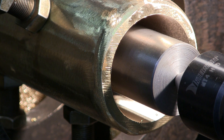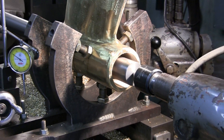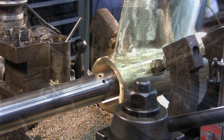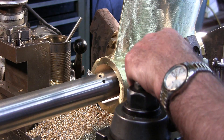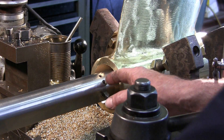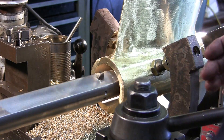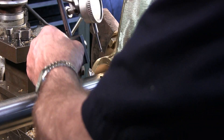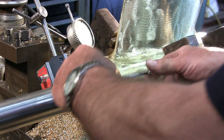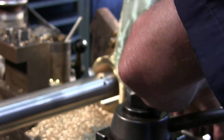The bar has been working super great and we're really happy with it. Now we've been using this angle bit here and we've extended it out — we have a little plug that we put in behind our adjustment. When we first started this job, I drilled and tapped two holes back here, but putting the indicator and adjustment tool bit on that side was not comfortable to me. I realized it was a lot easier to go ahead and take the mag base, set it up here, and then unlock our set screws and adjust it all from this side where I can see everything.